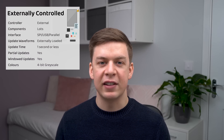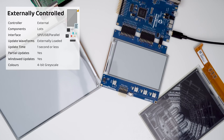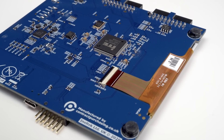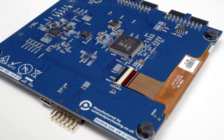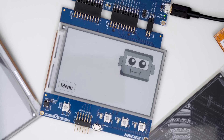The final type of display we're going to look at are externally controlled displays. These have all their components external to the panel rather than built into the controller on the chip on glass. These displays are more expensive but significantly more capable. Like complex AIOs they require external waveforms to be loaded, but they also require an external timing controller, PMIC, flash memory and temperature sensor. Their updates are fast, they support multiple update modes including partial updates and windowed updates. They come in sizes from 4 to 42 inches, support 4-bit grayscale, and are very well suited for UI applications like the Amazon Kindle.